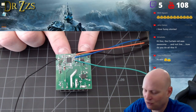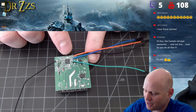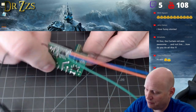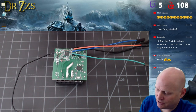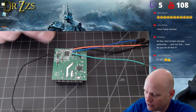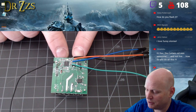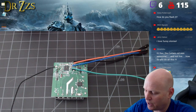So I did the only thing I could: hunt down the RX and TX pins on the board. I knew they had to be somewhere. They certainly aren't accessible or easy to get to like they used to be with the Basic — we used to have nice headers for jumper wires. Now we've got tiny little pads with no solder on them. I had to drop a little bit of solder on them and just barely stick a couple of wires to them.